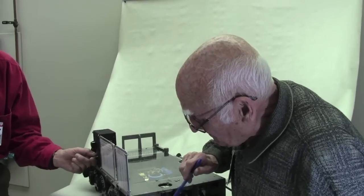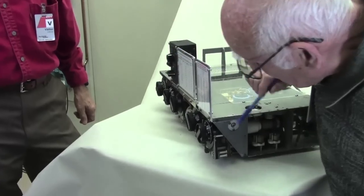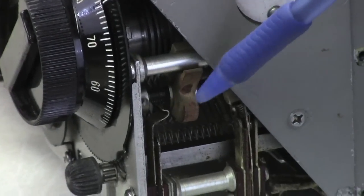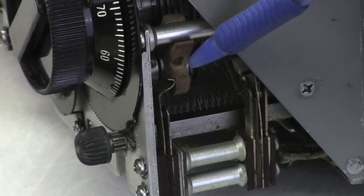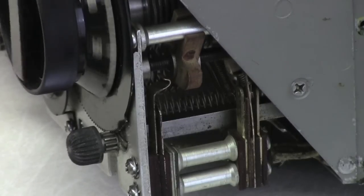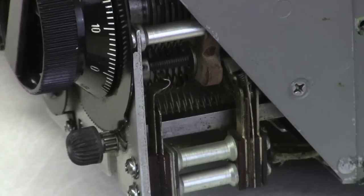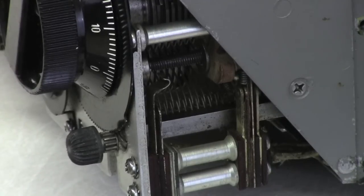We select a new channel. Notice all dials are in the counterclockwise direction. This is driving down toward the opening of this switch, and you notice there'll be a slight hesitation. It's open, and you notice what's happening is that the second switch, on the backside of this dial, had to find its open contact. It reversed precisely that time, and the proper pawls dropped to the proper positions at that time. That's part of the alignment of the AutoTune system.